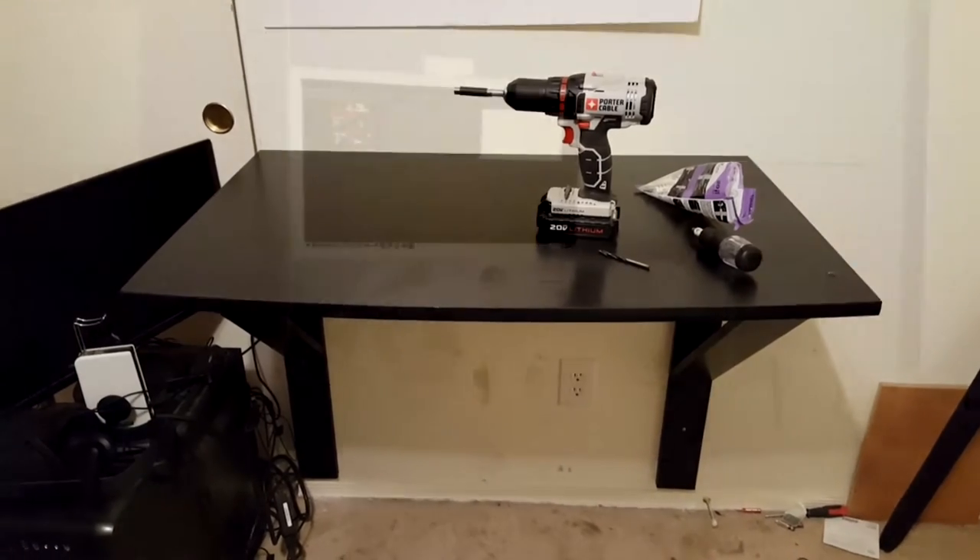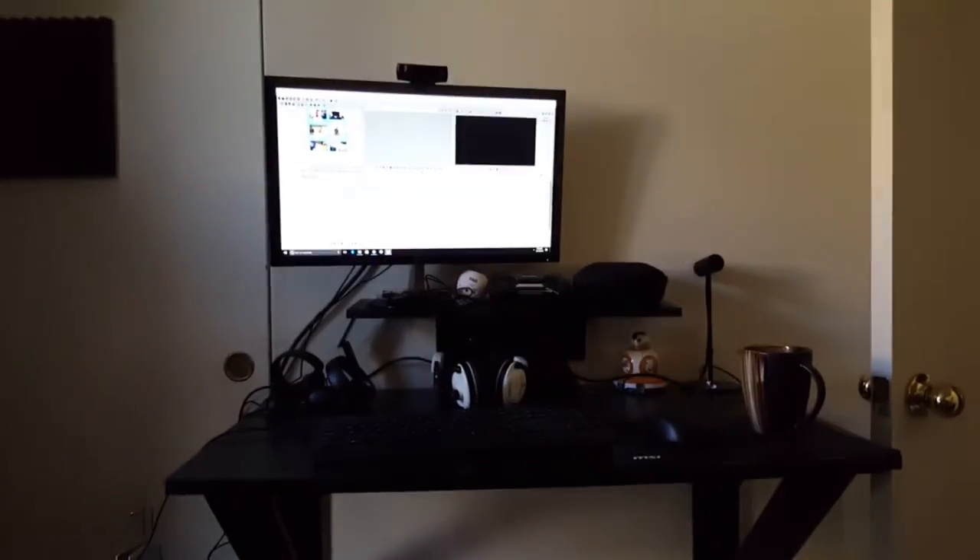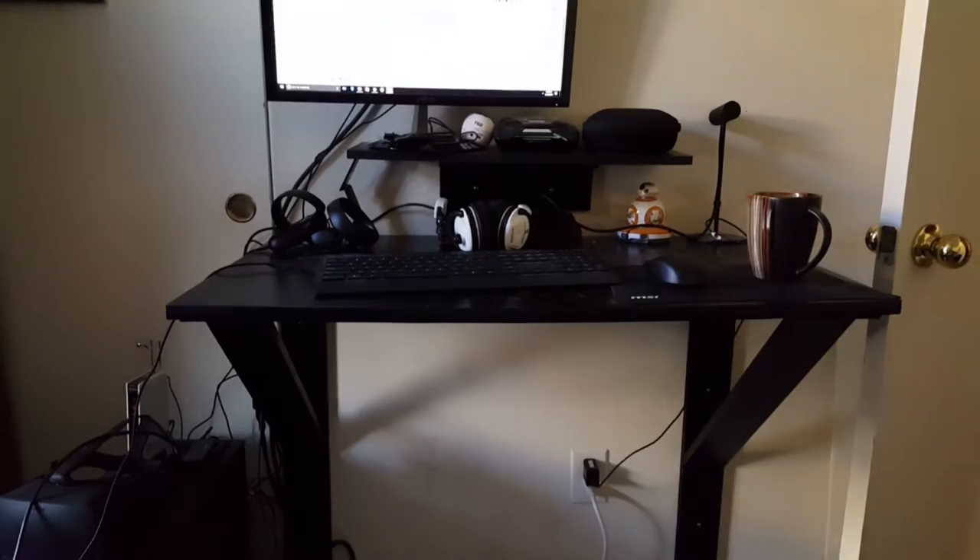What I've done here is I've drawn a level line. On the left hand side I've pre-drilled some holes — there's actually a stud there. On the right hand side I've just hung some anchors, and now I'm going to drill the brackets into the wall and then drill the desk into the brackets. Those are hung — let's get the tabletop. All hung — look at that, project well done! And here it is everybody, the final desk project. I added a shelf for my monitor also mounted to the wall, and as you can see I have much more desk space and just like an adult I can get up underneath it, get my legs under there. I've got plenty of room to work. It's awesome.